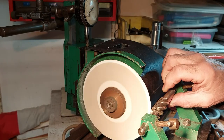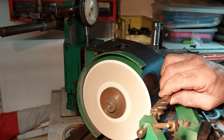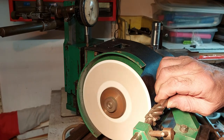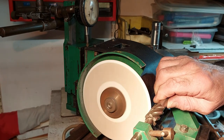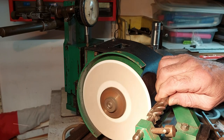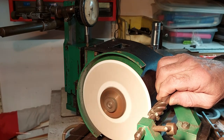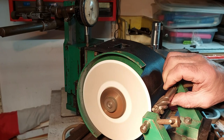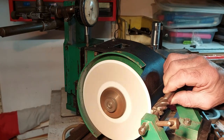With the wheel at the correct height, I just gently guide the end mill over the tip of the guide. This is the reason why you need the tip to be completely hard — if it was made of a soft material it would just dig in, whereas with it being pot hard it glides over. It's just slightly set back — not on the exact edge of the spiral, just slightly set back — so that the freshly ground cutting edge isn't actually riding on the edge of the guide.